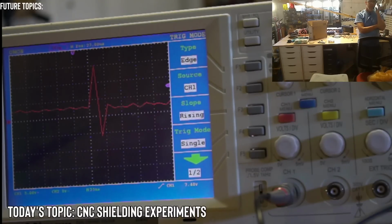These frequency spikes are dealt with using ferrite beads, if I'm spelling that right. Yeah, it's beads, B-E-A-D-S. I've seen it in printers, etc. Yeah, for sure. When we get to the point where we're trying to reduce the EMI, I want to do capacitors now. I'm kind of curious. But I'll do the ferrite beads. Somebody said resistor in line. Obviously shielding cable. And also winding a coil of the same wire around a toroid. I want to try to do that as well.